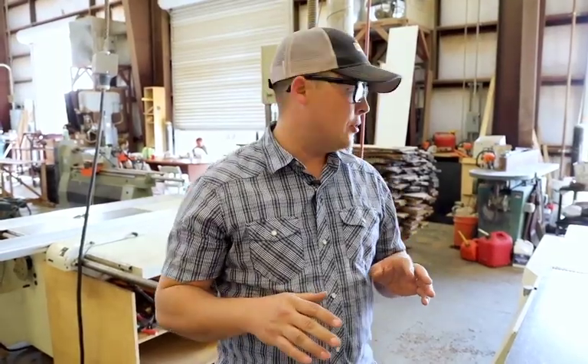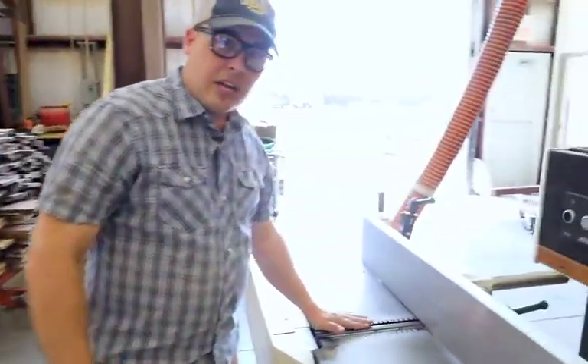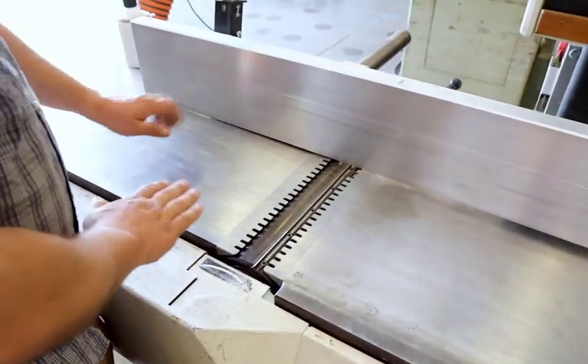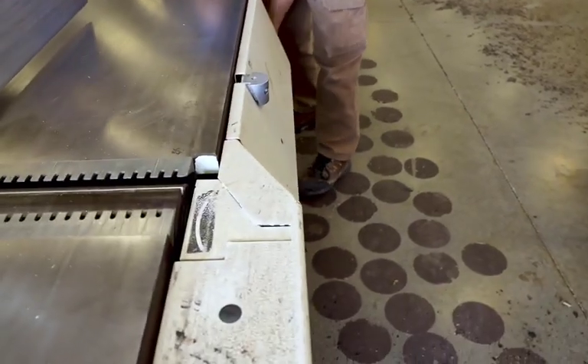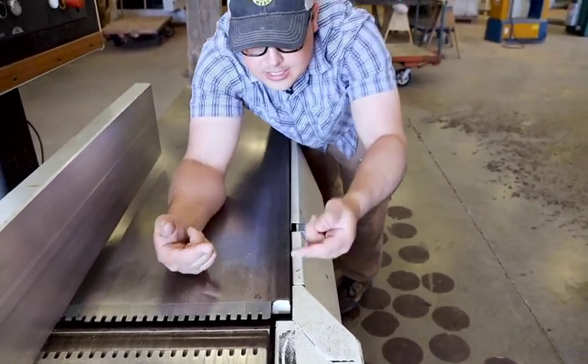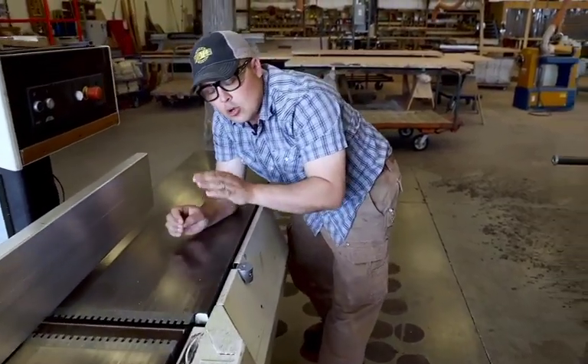The first tool I'm going to introduce you to is the jointer. The jointer is really important because it makes fast work of cleaning up and straightening the back edge of these beams. With a live edge beam it's really wonky, so we need to push it through this machine and flatten the back perfectly so it'll sit flat against the wall. A jointer has a planer blade in the table. On one side is your outfeed table — that stays static. This is your infeed table, and if you lower or raise it, the table drops or comes up. The wood goes in this way, the planer blade takes off portions, and the flat portion runs past on the outfeed side. It's a good idea to only take off a little bit at a time.